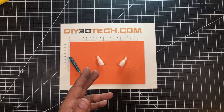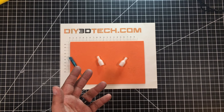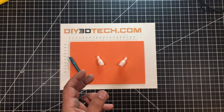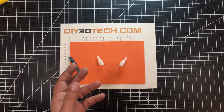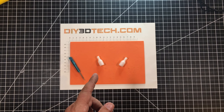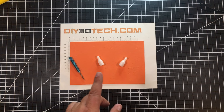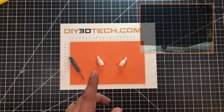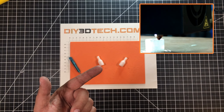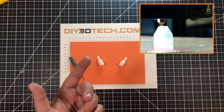What I do is use three perimeters. At 1.2 millimeters of thickness — dividing that out — that's three passes with the nozzle. That gives me enough to really do any type of infill: two to firm up the structure, and the third one really seals it. The other big trick I'll share is that when I do all of these in TPU, I use the vase functionality. This gives me one contiguous wrap of filament through the whole piece. It works great, and I don't have a lot of retraction because it's almost a straight-through feed. I'll be running some video of these printing in the corner so you can see it.